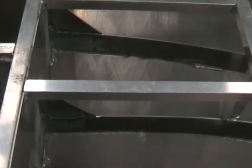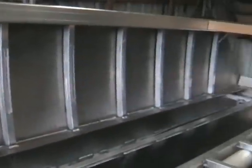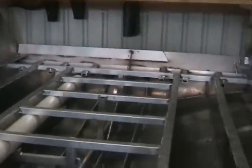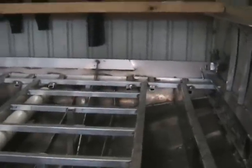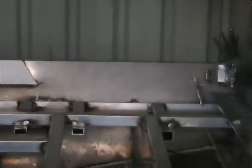And these stringers are all tied in. They're all bracketed all the way through to give it extra support, so there's no flex. The ribs are 40 by 40 RHS. At this stage it's just ready for a bit of foam. The channel that runs across the back there doesn't run all the way across at this stage because that's got to be cut out for the walk-through transfer.